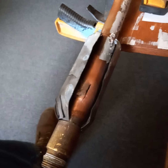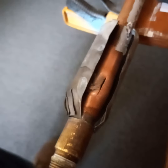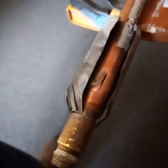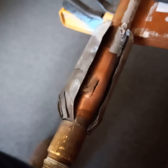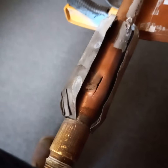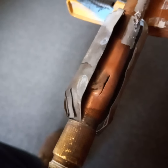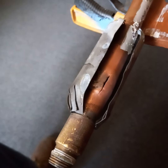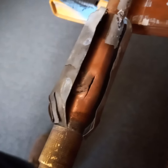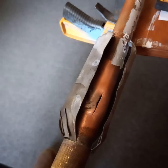Even though the oxygen acetylene torch is so much hotter, handier, and nicer, of course there cannot be any heat sinks around — like a compressor full of oil close by. You've got to be out of the wind, no airflow up and down through the pipe, so the end should be lightly capped off. And it's helpful to have the pipe possibly in the horizontal.